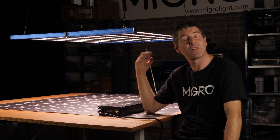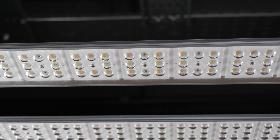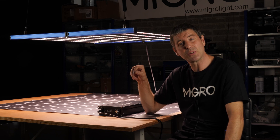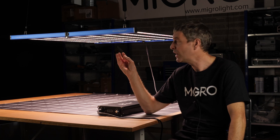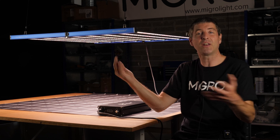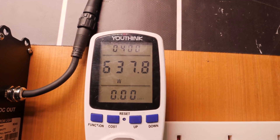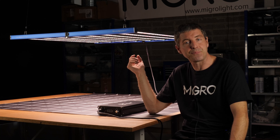The obvious upside is that you've got physical protection for your LEDs, protecting them against getting banged, damaged, wet, or dirty — so that's a good feature. The downside is that by shining through the acrylic, it's going to absorb some of the light and also diffract it into directions you don't want, because lenses aren't perfectly efficient. This will reduce system efficiency a little bit, especially as my test is done within reflective walls, where the walls would otherwise direct wide-spread light down onto the test area.